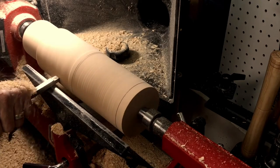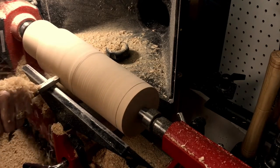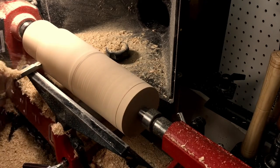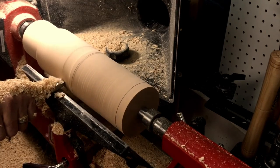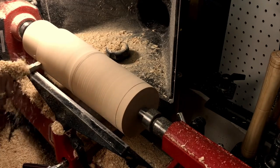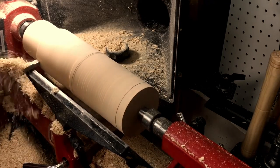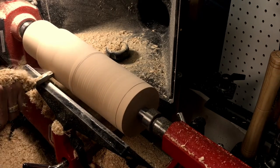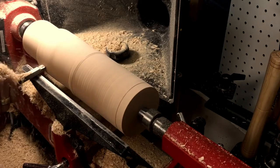Now I'm going to switch over to a radius square carbide cutter. These are great for transverse cuts going from side to side as in spindle work. Round or radius square cutter tips are just like the square tips other than they're slightly rounded on each side, which makes it easier making planing cuts or transverse cuts. You're also less likely to get a catch with that sharp corner going side to side, as with the regular square cutter.